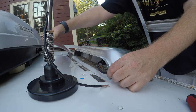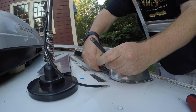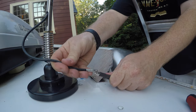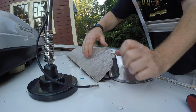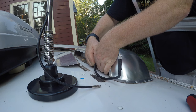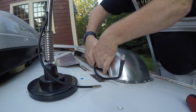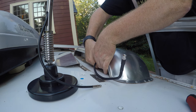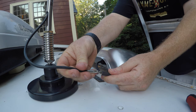What I need to do is actually pull out a little bit more of this wire, so I'm going to loosen up this cable gland a little bit and pull out a little more wire. Now I can make that bend without any trouble, and I have a little extra there for room to work. So that looks pretty good, and now I'll tighten that cable gland down again. That's nice and tight. You can use your fingers on this — you don't really need to put a wrench on it. Maybe check it every couple of years. And now I will make the connection here.